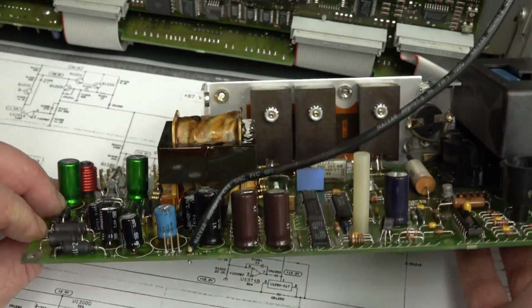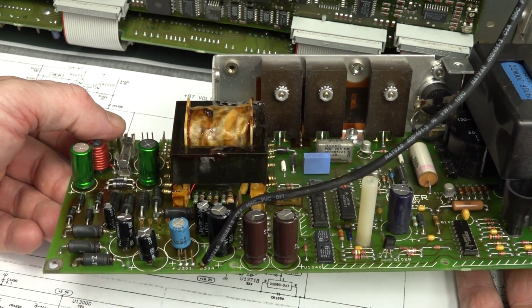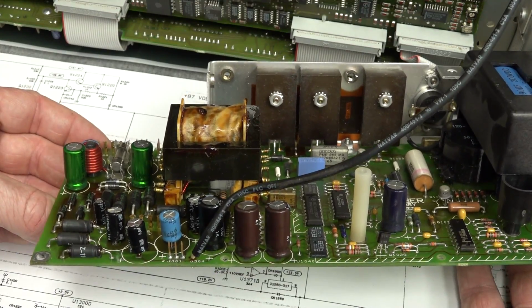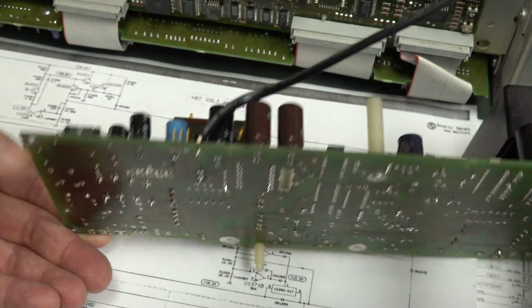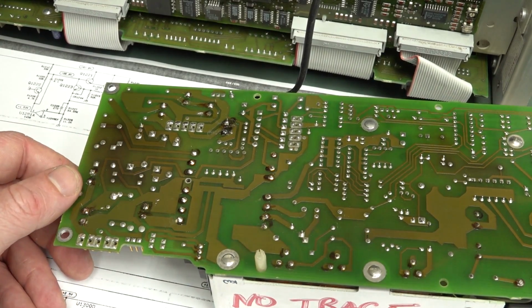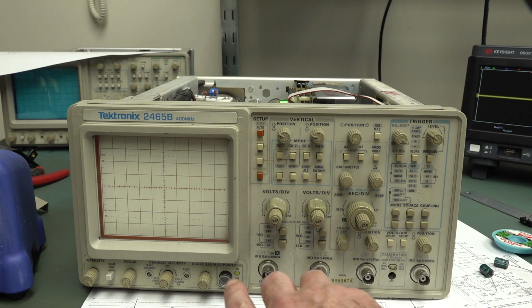So let's have a squirt. I think I might just go in there and replace the blinking lights. Something could be bleeding over to the 5-volt rail, but I can't really see how. But anyway, okay, I've actually replaced all the caps there, or at least all the major ones. So let's switch on,